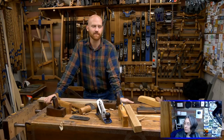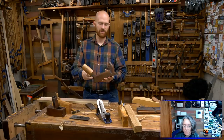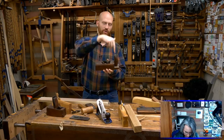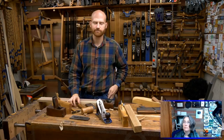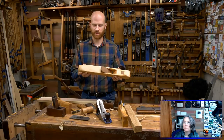Cody Bryant's plane has a strike button on the front and on the very back — does the button in the front project the blade out further? No, they do the same thing. It's what I was talking about earlier — either tapping the back of the plane or the nose. Because the iron is at 45 degrees, theoretically the best way to eject is hitting at 45 degrees from the back corner, but it doesn't matter much. Both the back button and the front button eject or back up the iron the same way. You'll see lots of planes that have buttons in both places.